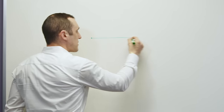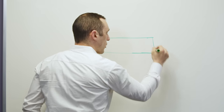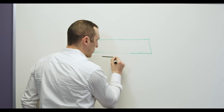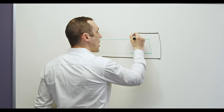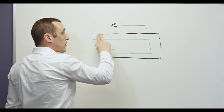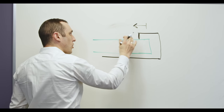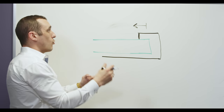Edge plating is commonly used in RF PCBs and there are different ways to put it onto a PCB. The plating is meant to wrap around the board edge and then wrap up to the top layer to a certain extent. The edge plating could encapsulate the entire edge of the PCB back to a pretty large distance, but there is going to be some minimum distance that you need to allow the edge plating to span over to the other side of the board.